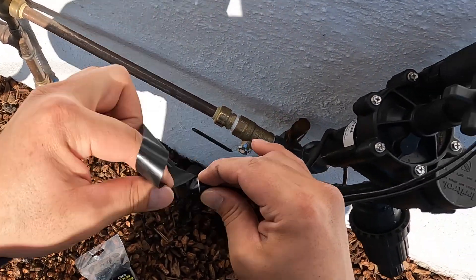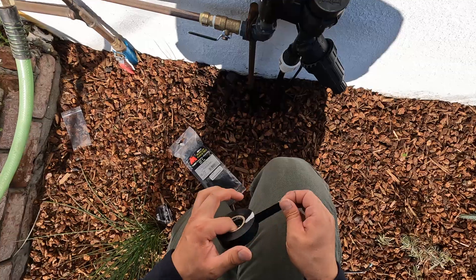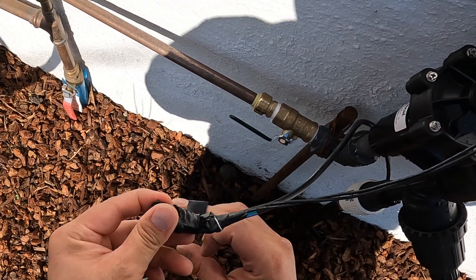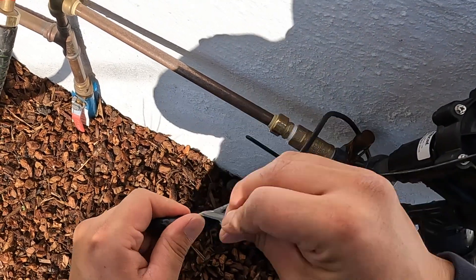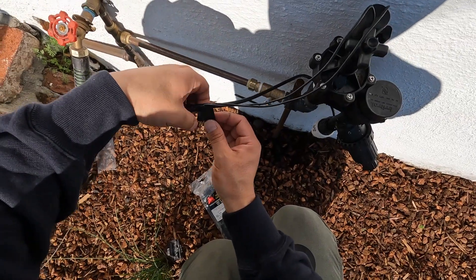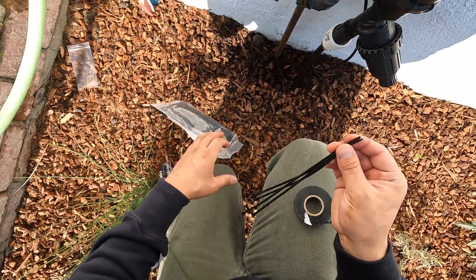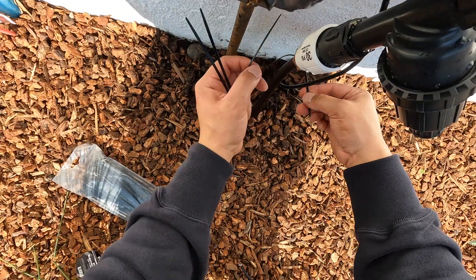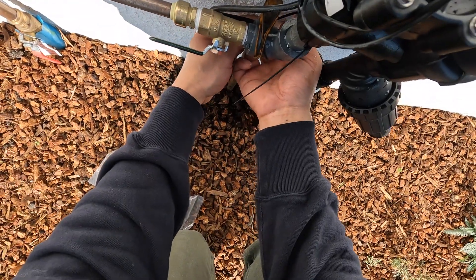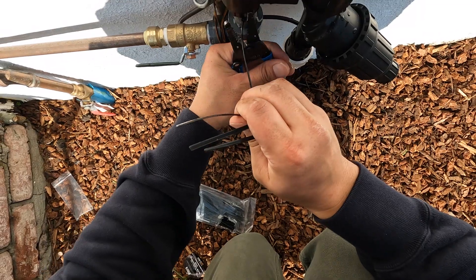Be careful — if you get that petroleum stuff on your hands it's really hard to remove. That's why I do these first layers of tape first, because I need something for the tape to stick on to. Sometimes that petroleum will come out and the tape won't stick. So I'm just covering the whole thing making sure it's waterproof — pretty straightforward. Now I'm getting some zip ties, just randomly picking spots to tie the line down to make sure it's all nice and snug, then cutting off the extra.